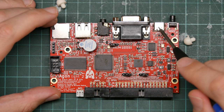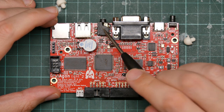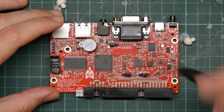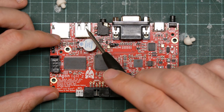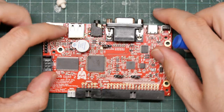It's powered by a USB-C connector. There's VGA output, audio output, micro SD card, assorted debugging, assorted GPIOs, and this — the keyboard connector. It is not a USB connector even though it's quite clearly a USB connector.